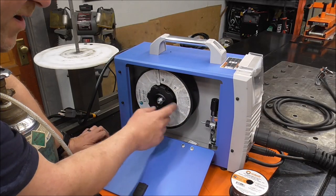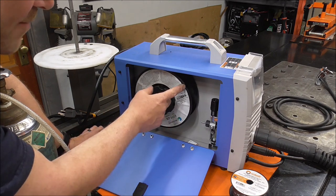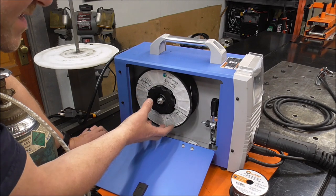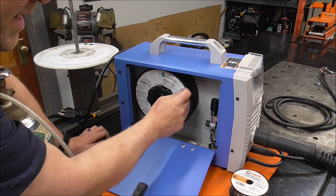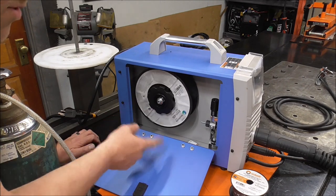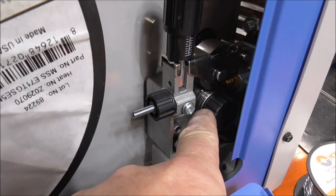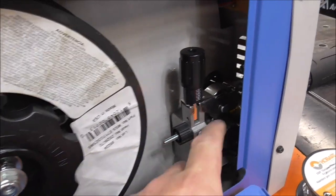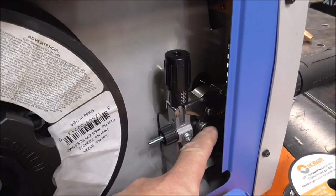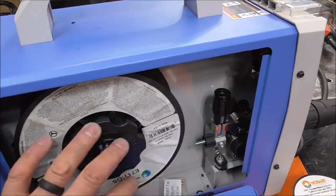The goal is we want this wire to come off the reel easily, but when you let off the MIG gun trigger you don't want the reel to keep spinning — because if it spins a little extra, it's going to come unwound and create a huge bird's nest inside the cabinet. But you also don't want the reel so tight that the drive rolls are struggling and slipping to pull the wire through, because then your wire will start stubbing and chattering and you won't get consistent feed.